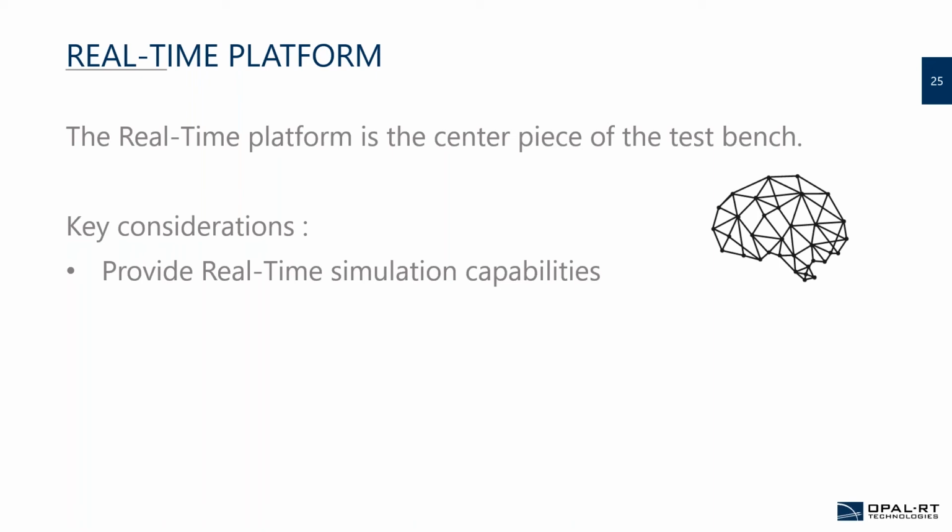What real-time simulation brings you is actually the dynamics between the unit under test and the simulator. So now you need real time. You have a real model of dynamics where the signals acquired will have some reaction to send information back to the UUT. So basically, if you have a command to change altitude, there will be a ramp, but it will not be as steep. It will be a smooth transition with the mathematical models. This is done in real time.